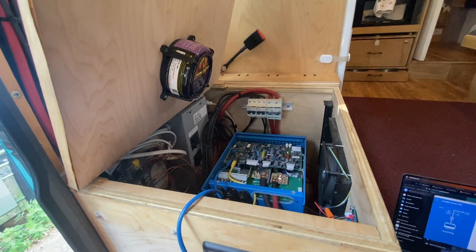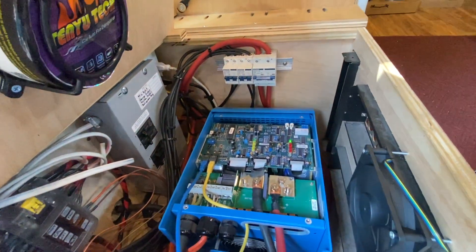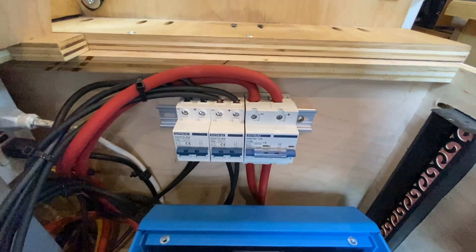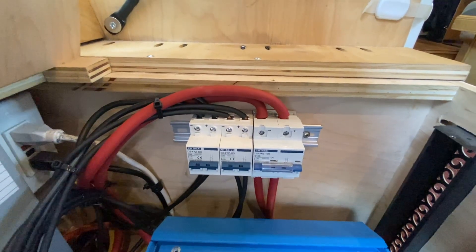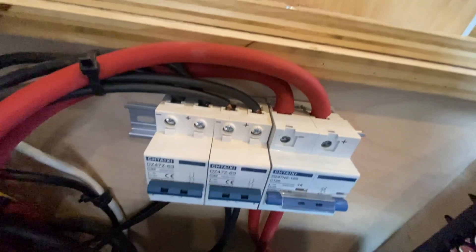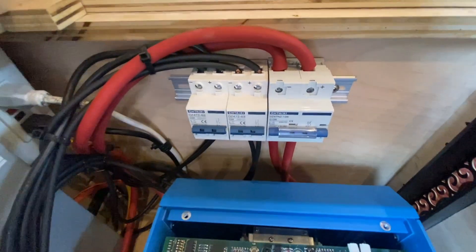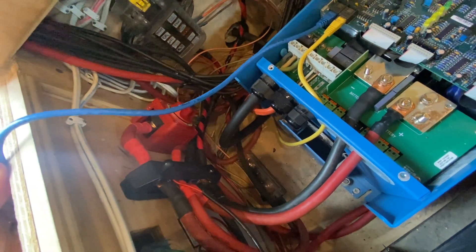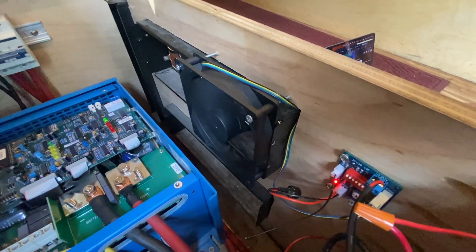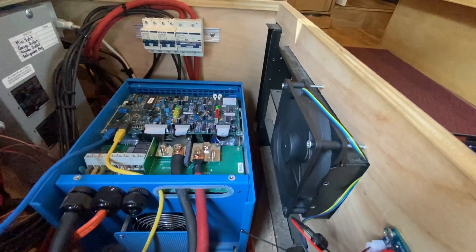So inside here, let's go over some of the updates and changes we made. We don't have a lot of room, so we ended up going with DIN rail style breakers partly just to save space. We're running the MPPT 150/70 chargers into 125-amp breakers, and then the solar into the 32-amp breakers — that's how we're controlling and protecting those. We also ended up doing a bus bar system and an upgraded disconnect switch just to keep everything cool, and we added a temperature-controlled fan to exhaust air out. They already had the venting in here, but we just made it work a little bit better.